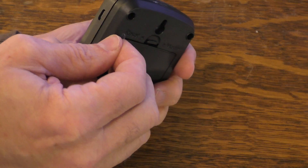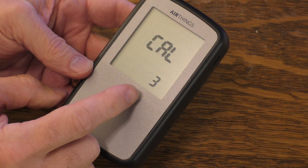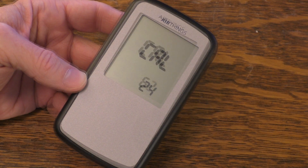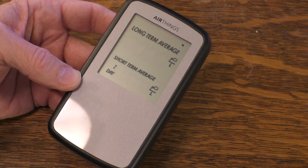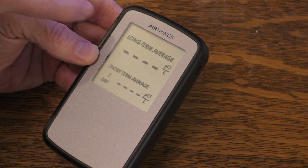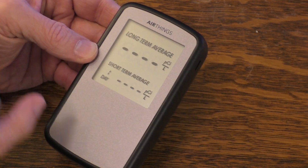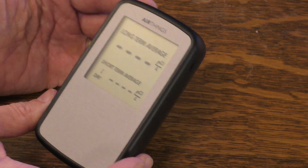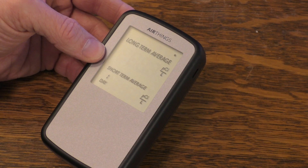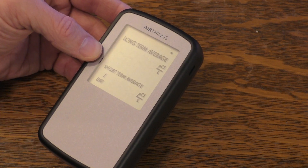Let's go ahead and pull this tab. Yes, indeed — it turns on. It starts a self-test and it's counting up. CAL means calibration and it says a minimum of a 50 count. We'll wait for it to calibrate. There you go — it looks like it's calibrated. You can see the long-term average flashing because it hasn't had time to read radon levels yet. It says one day for the short-term average. From this point on, I'm placing this where I want it. I'm placing it in the basement, about 20 inches off the ground and several feet away from any doorways, away from sun and water.